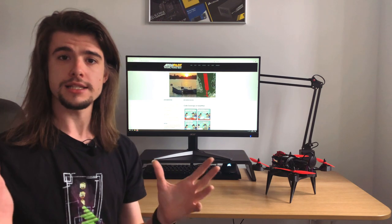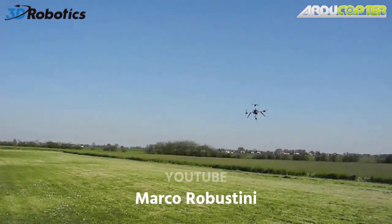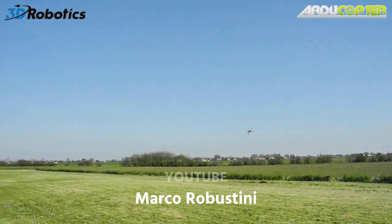With the Pi being a Linux board, this meant I needed a nice system image which also included a flight controller stack. I went with using ArduPilot. This software handles control of all the motors on the drone, as well as handling incoming sensor data like the compass and accelerometer, which is used to figure out the position of the drone whilst it's in the air.